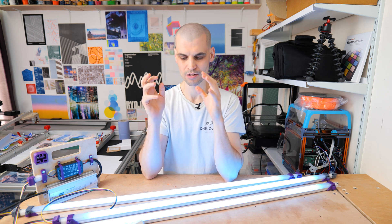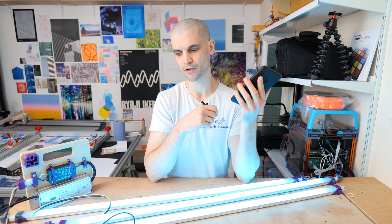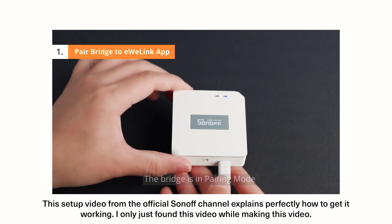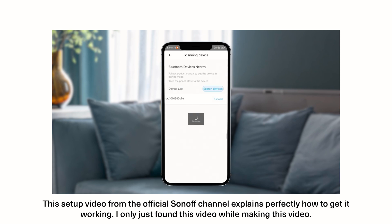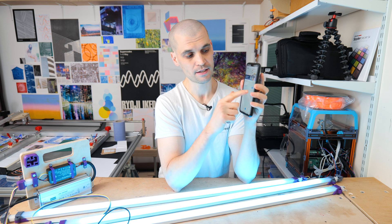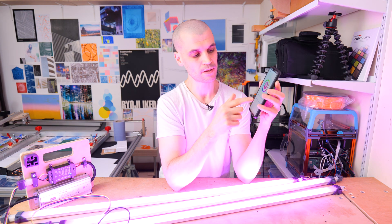Setting up the bridge and the app is not great — the documentation is pretty weak, and some of the app interface is in Mandarin. I'll link in the description to a video that goes into more detail on setting up the Sonoff or Zigbee bridge, since many brands make these. Basically it's similar to pairing a Bluetooth device: power both on, they blink to indicate discovery mode. It took a few tries to appear in the eWeLink app, but once paired you'll see it as a ZB Bridge sub-device. Clicking into it gives you full light control.